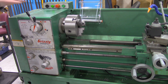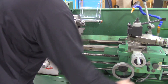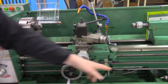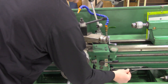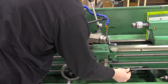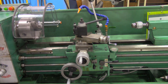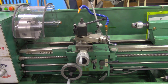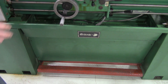Moving on to the controls for start and stop — we're going to bring the carriage over so you can see it a little bit easier. On the carriage we have an on/off switch located right here. This lever is our on/off switch. If we pull it away and then downward, that's going to run the lathe so that the chuck is spinning toward us. If we push it away and pull up, that runs the lathe in the opposite direction. There's also a stopping device located at the very bottom of the machine — that red bar right here — kind of like a panic button.